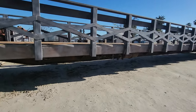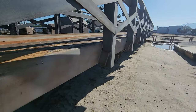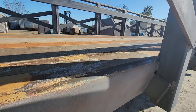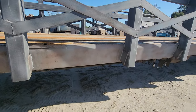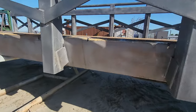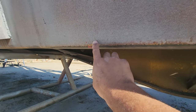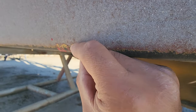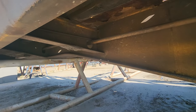That doesn't include the deck. The deck is obviously many more square feet — this one is 10 foot wide and 90 foot long, so that would be a lot more square footage. We're also not painting up underneath. You can see we have sandblasted this bridge — we sandblasted all the old paint off. The old paint is typically in really good condition; they use really quality paint, but we're not painting up underneath.